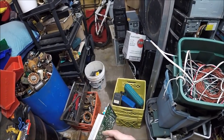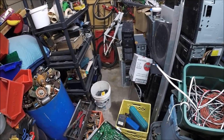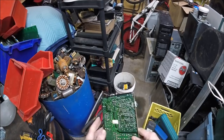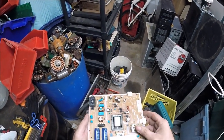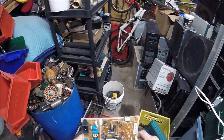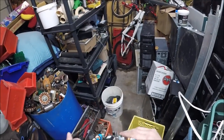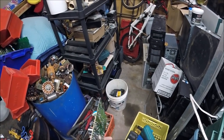You'll see the whole process. They grind it once, then they fine grind it so it turns to powder, and then somehow they separate the copper. One area of copper goes down, fine powder, and some mixed metals. A lot of these components, like little relays, have copper. But what they'll do is depopulate this board completely and put it into a tumbling thing, almost like a dryer with heat from propane, and the components fall off. Then when it's depopulated, they grind the board.